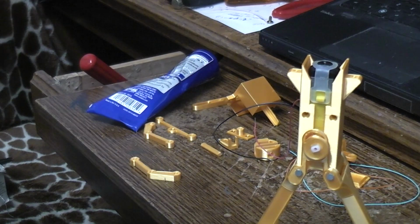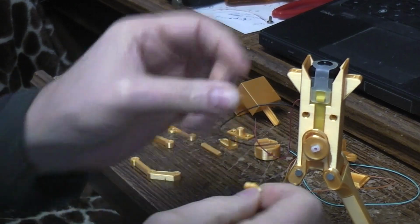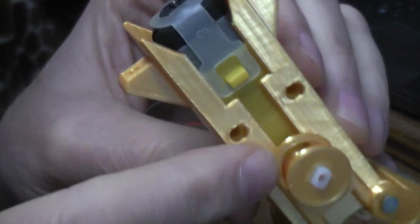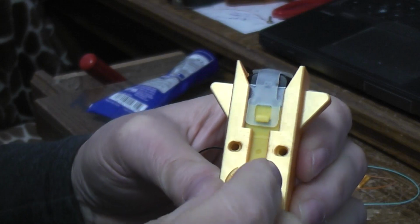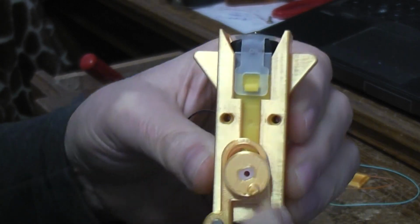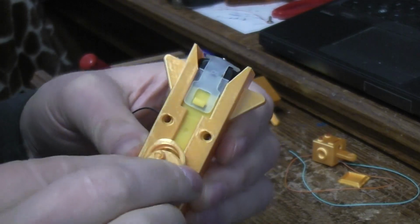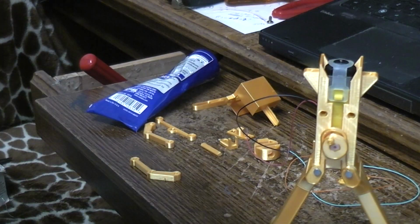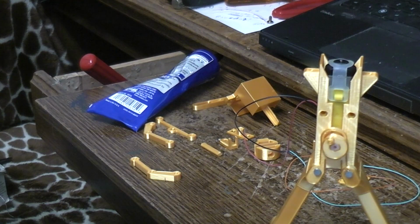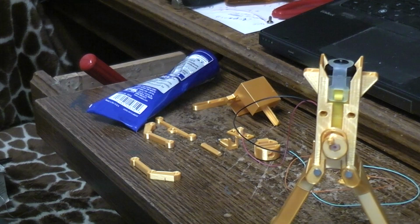The white robot that I showed you at the beginning, I had the arms and the legs moving in opposite directions, and the way you would do that is, this large cam up here that's hitting that is right now near the top, so if I wanted them opposite, I would put this onto this shaft and glue it in that position so it's on the bottom. But if I want everything to move the same way, I would put them on that way. I'm not going to glue that at this moment because we don't know what it's going to look like. I've never looked at it that way. I just assumed I would want the arms swinging the opposite way that the body swung. But who knows? Maybe it actually would look cooler swinging in the same direction.